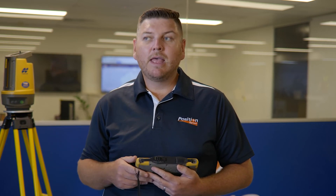The LN series launched in Australia in 2014. However, the latest iteration, the Topcon LN150, launched in April 2020. It has extended range over our Topcon LN100 — we now have a working distance of 135 metres, giving us a working window of 270 metres, and an increased vertical aperture, meaning we can also work at increased elevation changes.